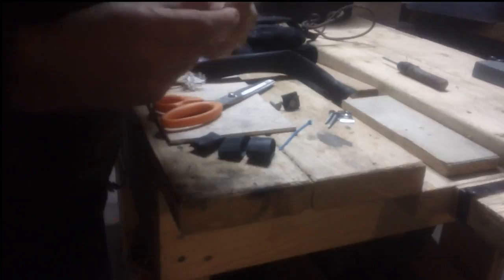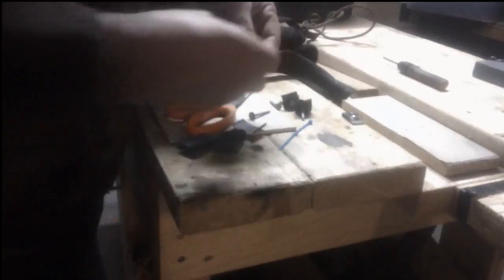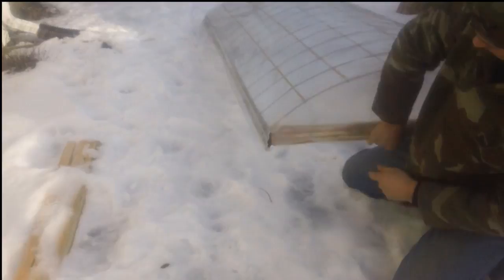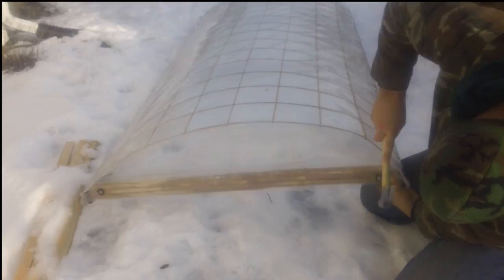What I did was drive a nail through a folded-over piece of rubber from a tire tube. By tacking the plastic down with that, it gives better purchase because it's rubber — better friction. Also, it keeps the sides of the nail from ripping through the plastic under stress. It's just using stuff I've got kicking around — I've always got roofing nails and tire tubes on hand. About four nails seemed to do the job for each end.